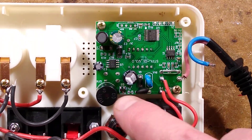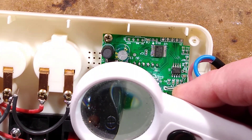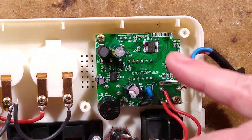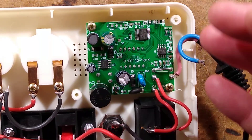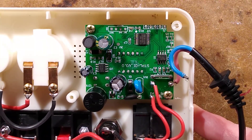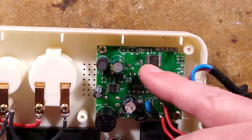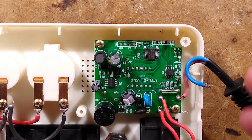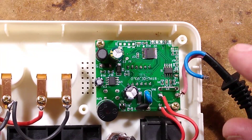There's a little microcontroller, and over here there is a little buck regulator based on an SM7035P buck regulator chip. There's an inductor and the output capacitor for the power supply. What it's doing is measuring the voltage drop across this current shunt and buffering it up with this chip. It's presenting as an analog signal to the microcontroller, which then just multiplexes the LEDs crudely using the minimum components possible — very cheap, which means the segments are all different intensities.